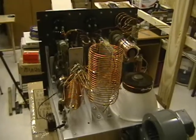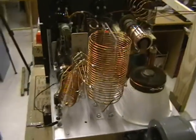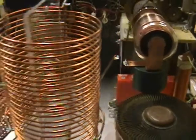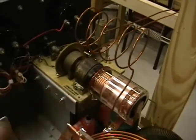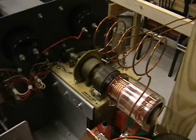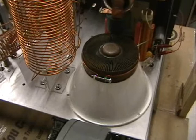This is a view of the rear of the amplifier. The large coils shown here are for use in amateur radio service — they are not used in Rife operation. Here you can see the wire has been disconnected from the output of the amplifier tube to the input circuit for the coils for amateur radio service. A separate coil has been added, shown here, above the vacuum tuning capacitor. This resonates at a frequency of approximately 11.78 MHz and is used to tune the amplifier to that particular frequency of operation. The amplifier tube is an RCA type 7C24, commonly used in television transmitters.